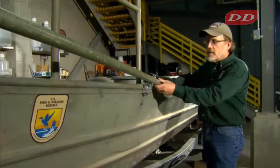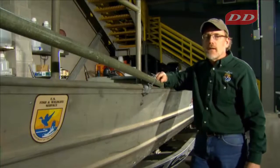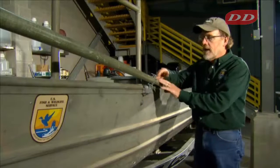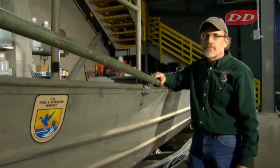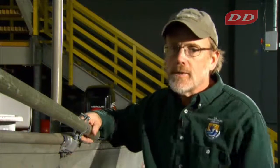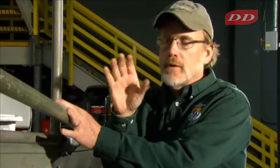The boom material typically is fiberglass or PVC, but some non-conductive surface to keep the anodic line and the cathode separate. Having booms fixed in place on metal-hulled boats is a must. You don't want a movable anode on a metal-hulled boat, because if the electrode touched somebody inside the boat, you'd be bridging two different electrodes and completing a circuit.